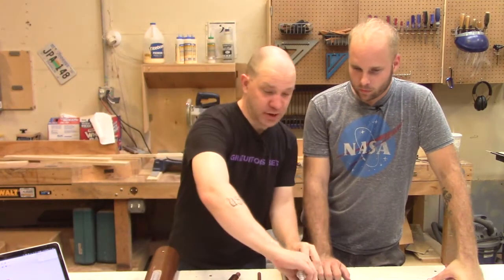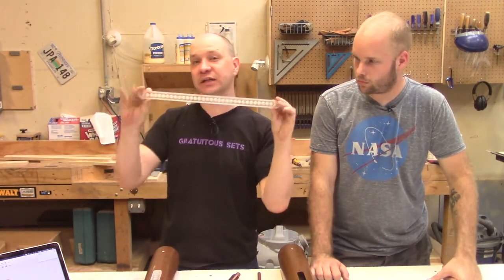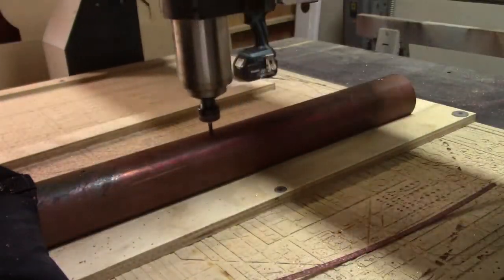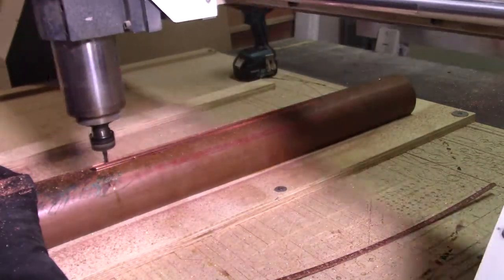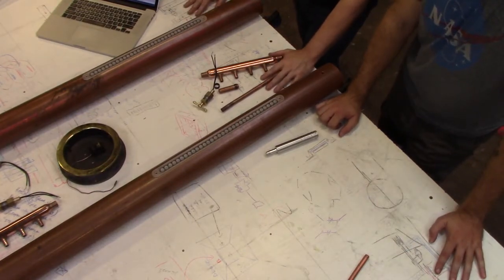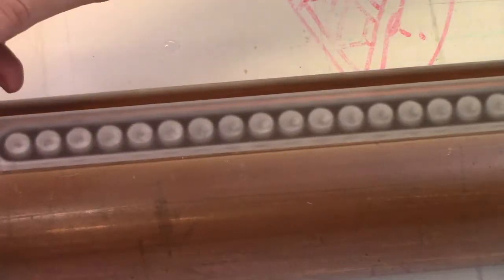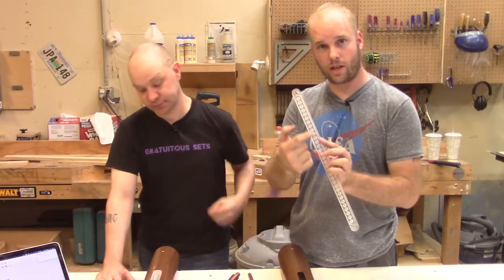Moving on down here, we took our pipes and milled out these slots. These are going to be holding our 32-inch LEDs as part of the puzzle. We put those on the CNC machine and made a special sled so that the pipe sits flat and registers to the right point, then milled out that oval to receive the LED. We're actually going to use a piece of quarter-inch Sintra on the underside — the LED sits tight into that and just pokes up into these little recesses on the back.